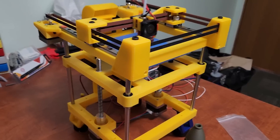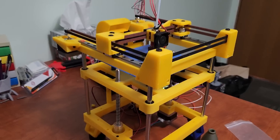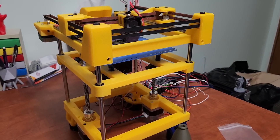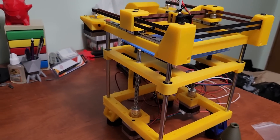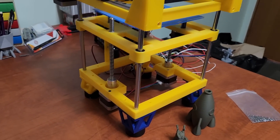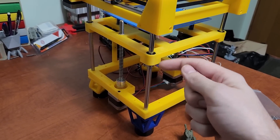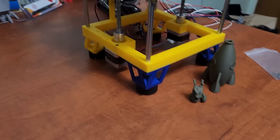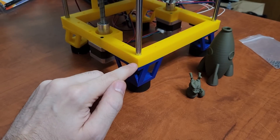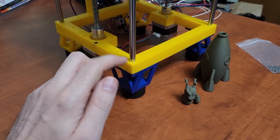Maybe you could use a Revo or something like that, though admittedly a Revo is probably a bit too much money for a printer like this — it's almost half the cost of the entire printer. Pretty standard LM8UU bearings for the Z axis. Like I said, these are 150mm lead screws and the linear rods are 200mm. They actually press into the 3D printed part — the bottom frame has a hole that doesn't go all the way through, so the rod gets pressed in until it stops.